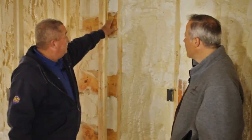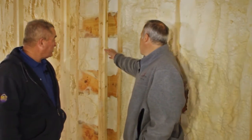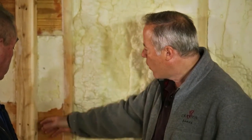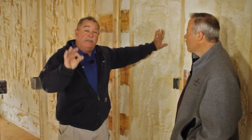I see that you've got some unique framing here. Is this a two by six? What's behind this — is that all foam? Yeah, in a traditional framed home you'd typically have a studded pocket back here where you wouldn't get insulation, but with new framing techniques we're able to put horizontal members in here. With the blue board outside and the two by six foam wall, we've stopped almost all infiltration and moisture. If you're living in a home that's 15 to 20 years old without foam, look around your door jams and your electrical boxes — you'll notice little brown stuff. That's infiltration from outside where outside air is filtering into your house, so you're heating the whole world, not just the people in your house.